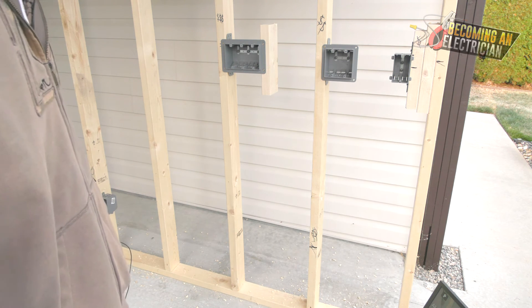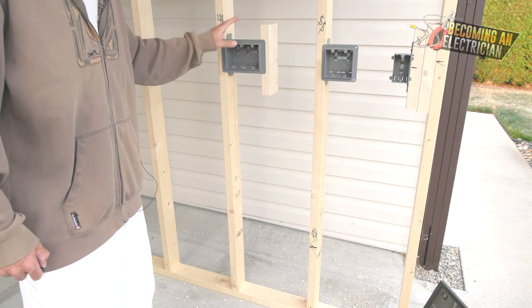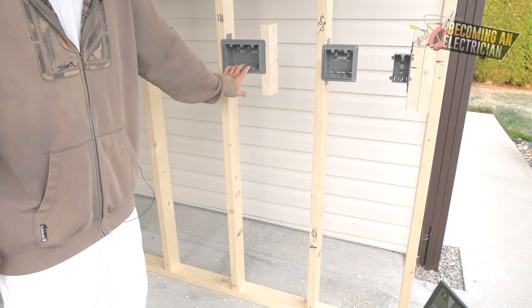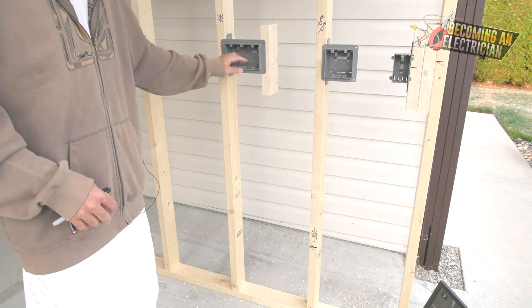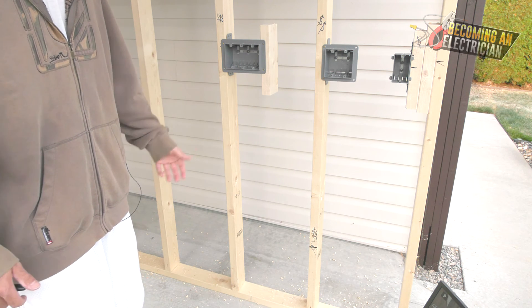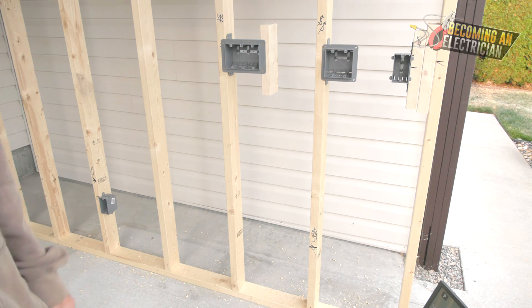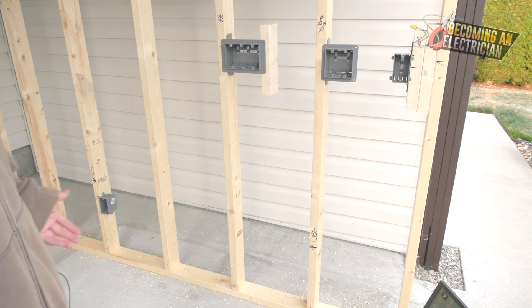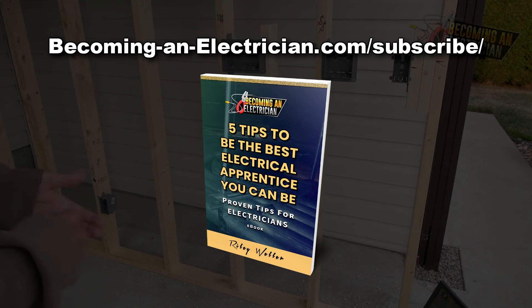Okay, so we've done quite a lot so far — drilled holes, installed some boxes. I'll probably do a little bonus for you guys and share how to install wires into a three-gang and how to make it look nice, because this is a big thing for a lot of apprentices — they usually just shove wires in there and everything's crossing. I like to always have wires nice and organized, nice and neat — it makes it so easy for maintenance and knowing what's going on. That was it for this video. That is how you drill holes. Pretty simple, but as an electrician — shout out to Bob — you drill them straight and it makes it easier to pull your wire. It's the little tricks you get from your journeyman that allow you to do a lot better as an apprentice. Check out my free book for apprentice electricians at becominganelectrician.com/subscribe.